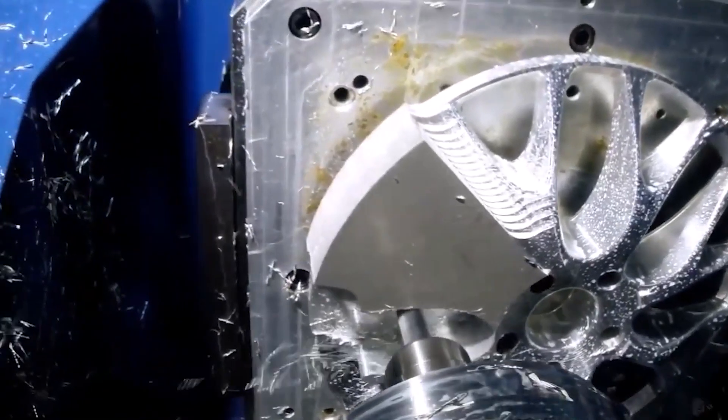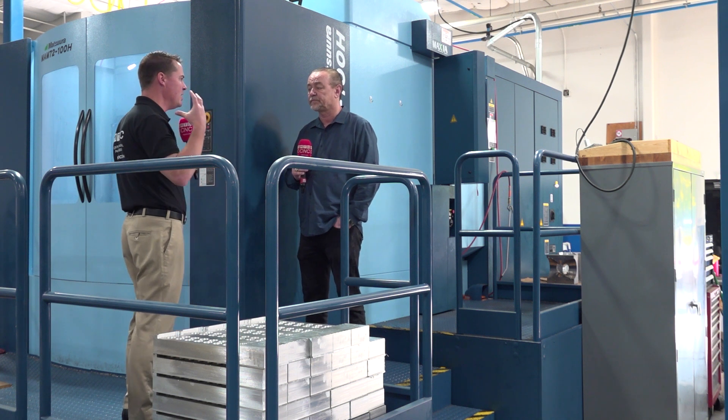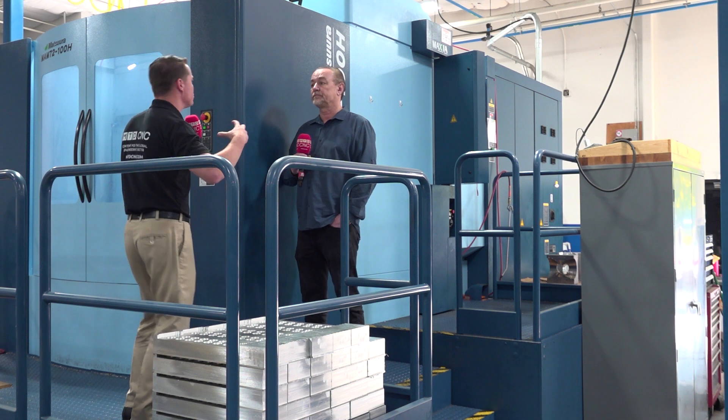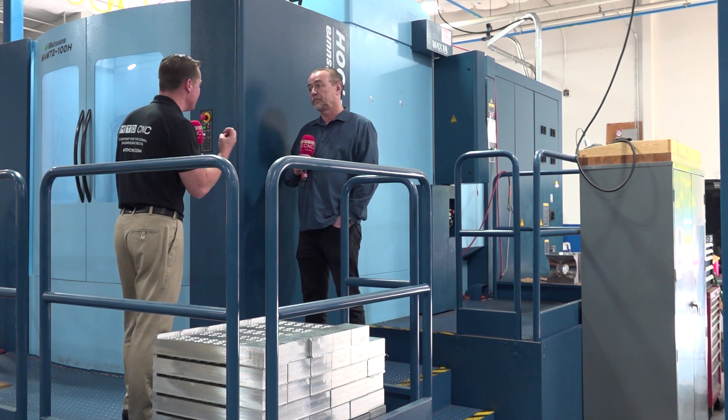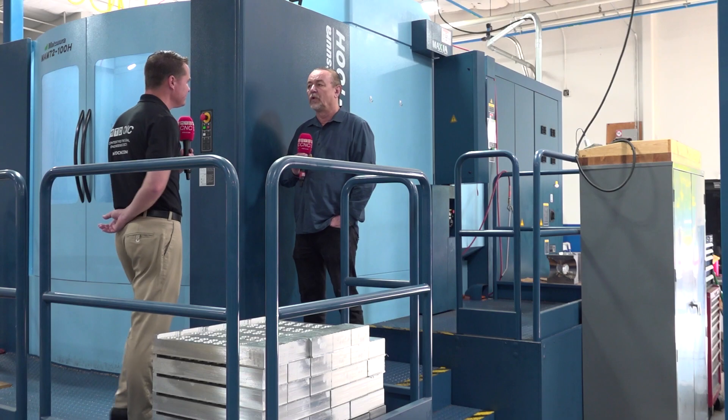And the fact they put so much tool capacity — like these machines over here, they have over 300 tools each. I think this machine has 245 tools. The versatility of that is effective in so many different ways. You can have multiple jobs set up and not have to break the tools down. It's really effective. When we think of softer materials, the ability to have multiple jobs on here, or if it's harder materials, tool redundancy. Something we don't think about oftentimes is if we're running a bunch of jobs and we don't have enough tool holders, that's longer downtime. The machines have all the capacity to probe. So if you are running tough materials, you can have your probing cycle come in and change to a sharper tool. It's nice to have all those preventative and precautionary systems built into the machine — the scheduling, everything. It's all one package, put together real nicely.